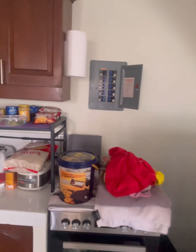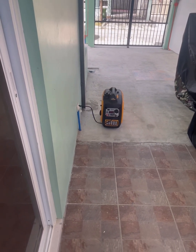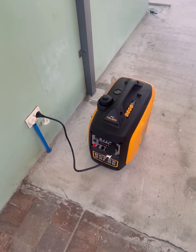Please make sure that when your power comes back on, you kick off your generator first before you kick your main breaker back on. Right now we are powering up the whole house with the generator.